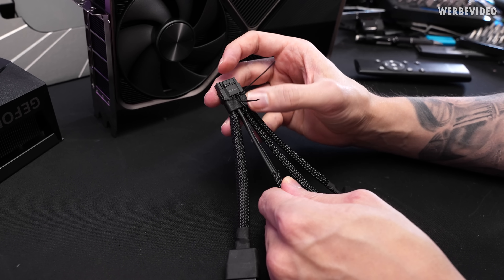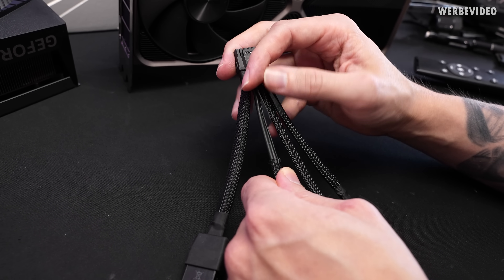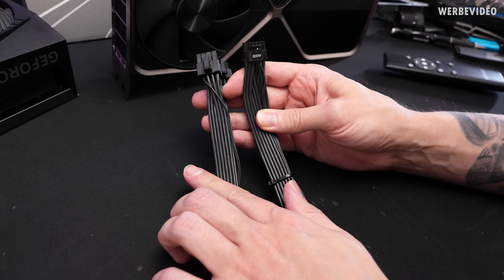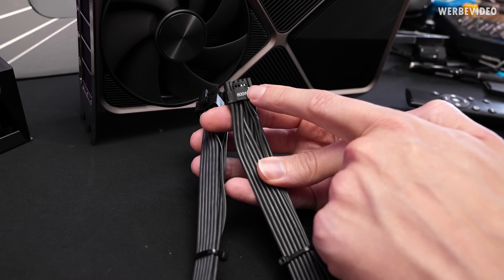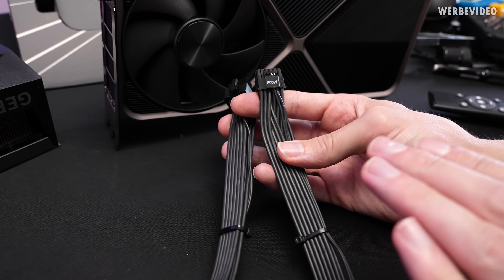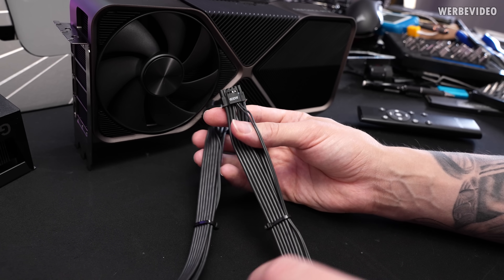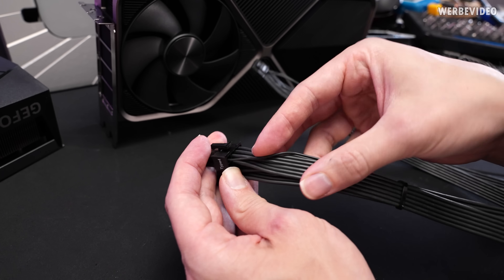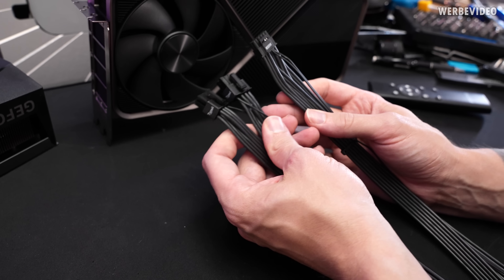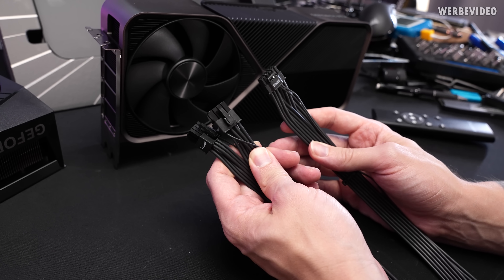Why are there two unused cables in here? That's pretty strange. But it also reminds me of a cable I received from Corsair — you can see it's only using two pins out of the four. So it kind of makes sense that the other pins are also not connected on the NVIDIA cable. We can see two wires exiting from the additional sense pins and if you check the connector, they are just bridged to ground. So it's just a pure ground connection on the cable. What I find a bit entertaining is that this gives you basically the same as two times eight pin, while the other one needs four times eight pin.